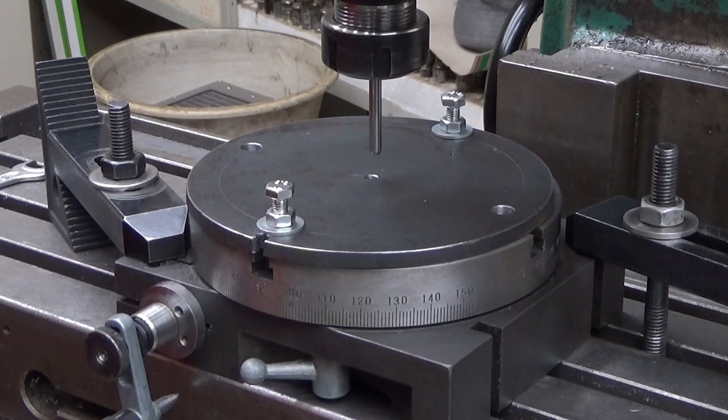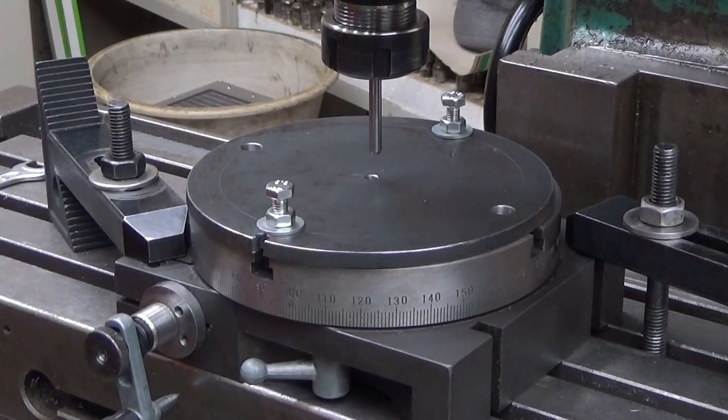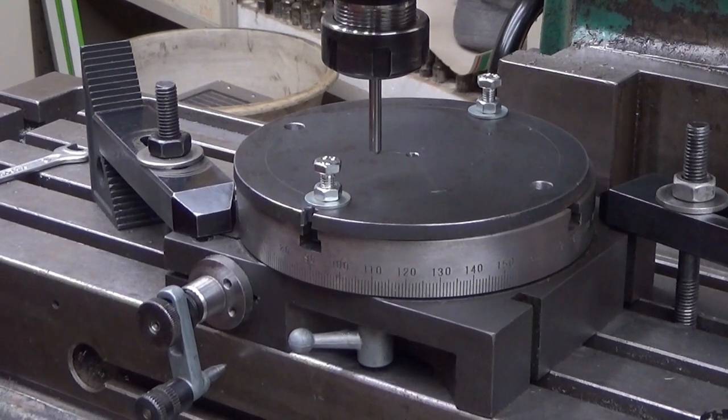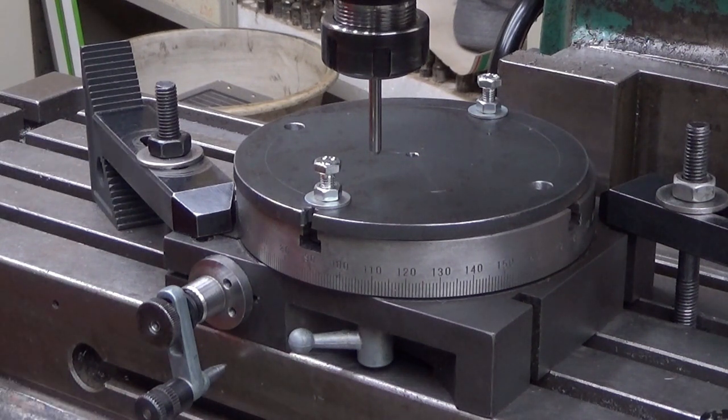And now the only thing is that we need to determine the radius of this bolt circle, and it's some equal amount of millimeters. I can measure it here, and it's actually 30 millimeters. Yeah. So 10, 20, and 30 there. There is your 30. Okay. Well, now it should be in place. X and Y.